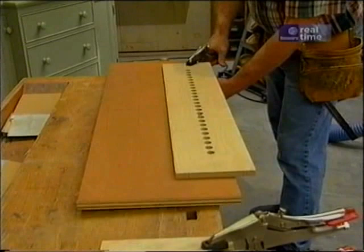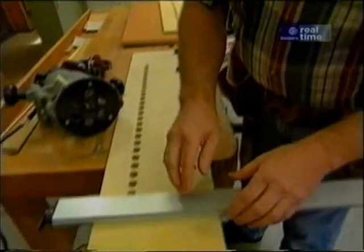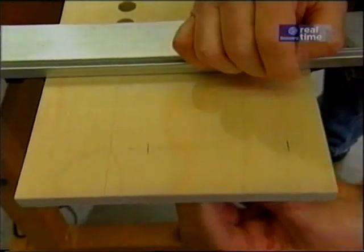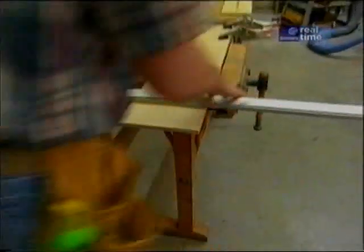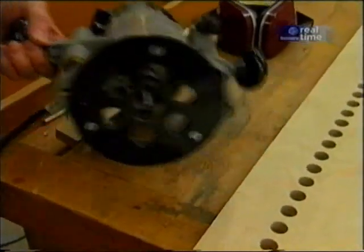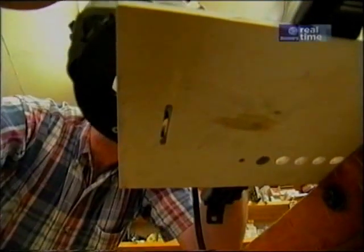On the commercial jigs, they have a pin in quarter-inch increments to set that distance. I would like to have a finer adjustment. So what I'm going to do is cut a slot here so that we can mount a bar underneath and have a good range of adjustment. I've put a straight edge clamp across the piece, set up the router with a quarter-inch bit. The distance from the center of the router to the edge is equal to the jig layout, and I'm just going to cut a slot all the way through.